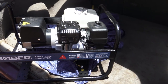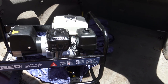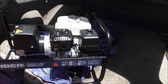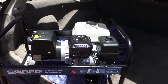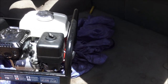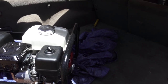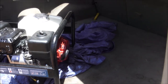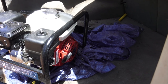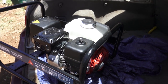They may be a little bit bigger and a little bit heavier, but around here with natural disasters, storms, and bushfires when we lose power, you want a generator that's reliable and not going to fail you. It's much, much easier to service — oil changes, clean your filters, spark plug changes, and so on. This one is a pull start, not a battery start. These are a much better design for our summer temperatures.